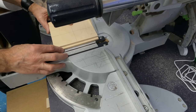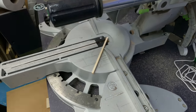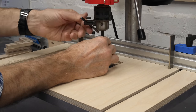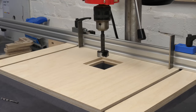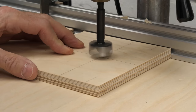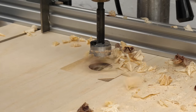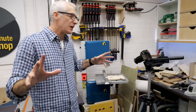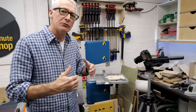Before we get to the drill press I'm just going to trim this end off to even it up. Back at the drill press I've swapped out the 5mm bit for a 30mm Forstner bit without moving anything, so the stops are all set up and ready to go — we can just drill that through. Then the last thing we need to do is on the bandsaw, just cut out those corner notches, and they give us the 37mm setback.